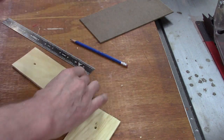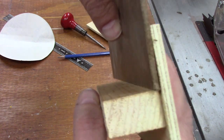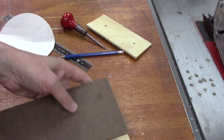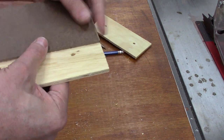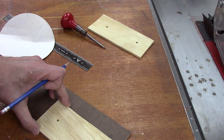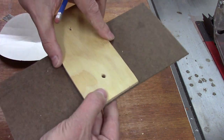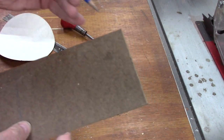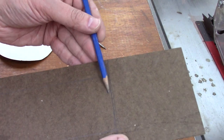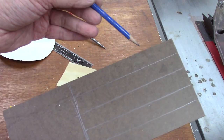You can start sanding right away with the same pieces. A couple of pieces of masonite there give you that overhang, so when the sandpaper's there and you're sliding it across your piece like the plane, it'll stay centered on the sandpaper. You need four pieces, and you make it slightly smaller, roughly divided into four different pieces.